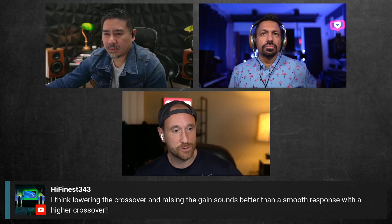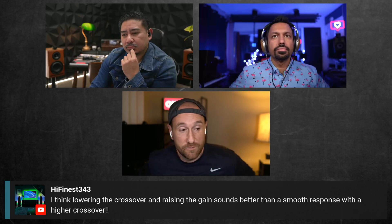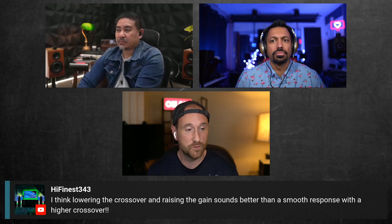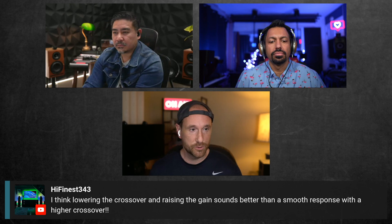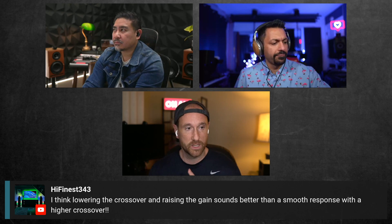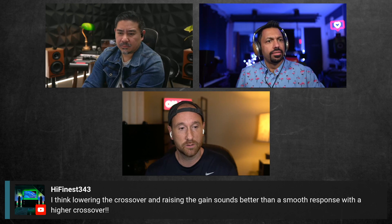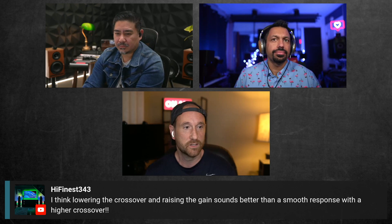It's kind of weird, especially when you're not at the helm — you're basically given whatever the room and speakers give you, and trying to let your AVR correct for it. But if you spend the time, which a lot of people don't, to really move subwoofers around, measure, try different crossover settings, different slopes, different phase orientations — things like that in the software and on the amplifiers themselves — it takes work, and you've got to know what you're doing at least to some degree.